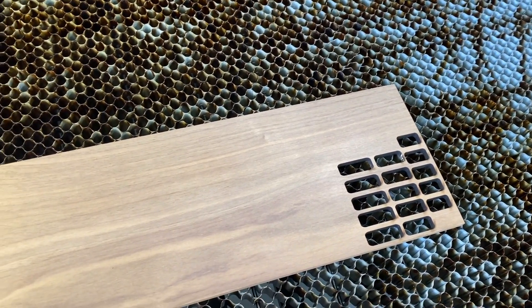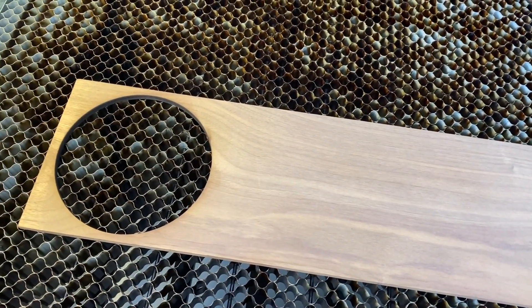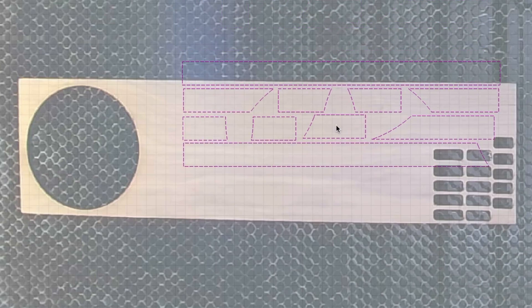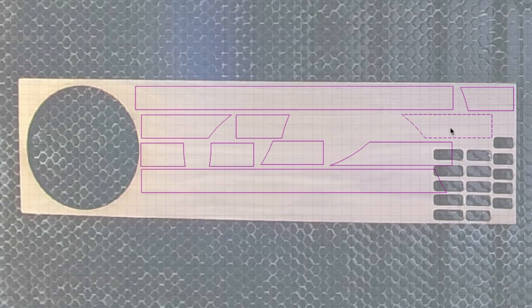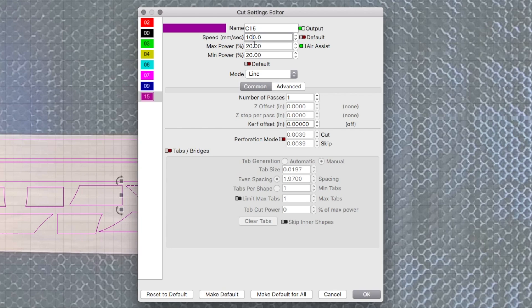I was working on this custom army flag and my customer really wanted to use walnut. The only walnut I had here was completely butchered — it had marks and spaces all over it. But instead of running to the lumber yard to grab more wood, I looked at the pieces that I needed to cut and looked at my pieces of wood and realized that I could probably fit everything in using the Thunder camera. In Lightburn, you'll just turn the camera control on and update the overlay to reflect what's on the bed of the machine. I brought in the stripes of the flag that needed to be cut, then just moved each one around so that it fit properly onto the wood. I changed the settings for the cut and then sent the file right to the laser.